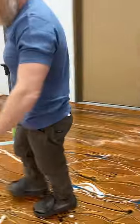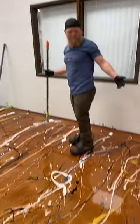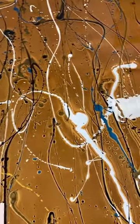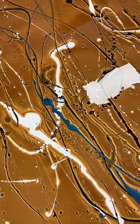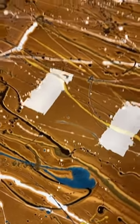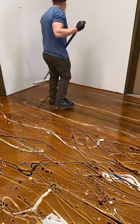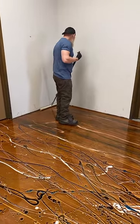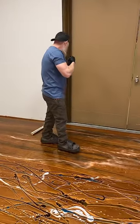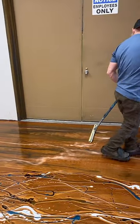I'm going to try one other method. Why do I love the droplet effect so much? Bubbles come out very easily with alcohol on most flooring, and a torch on other flooring. One thing to remember — never mix the two because alcohol lights on fire. And that final swipe with the T-bar is going to bring this together pretty nicely.